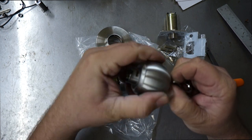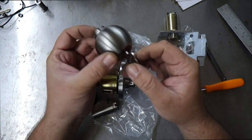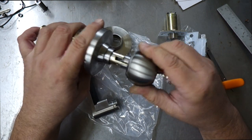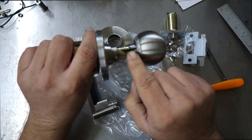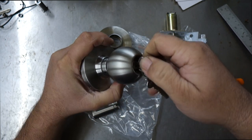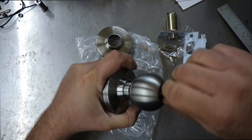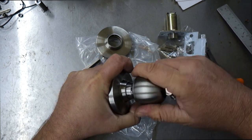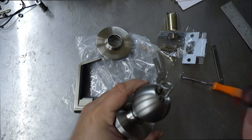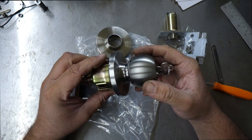That's a prime example of being hard to get off — once you feel a little give it starts to move. What I did was pull the key out a slight fraction and turn it back to the 12 o'clock position. Now I want to put the knob back on the correct way up, so I'm pushing it in and wiggling the cylinder so it lines up with the groove. I put the key all the way in, keep pushing the knob back, and find the pickup point for the cam — turning the key back and forth until the knob clicks into the locked/unlocked position.